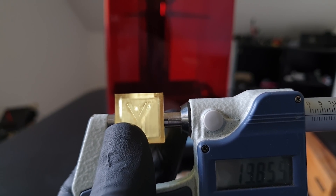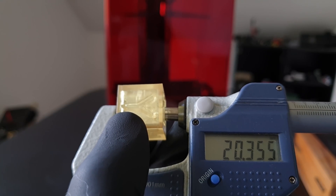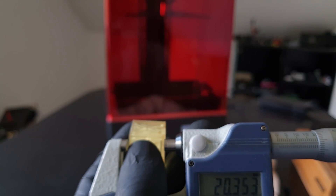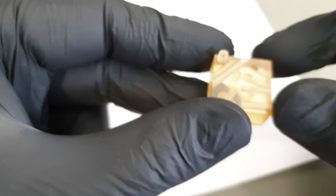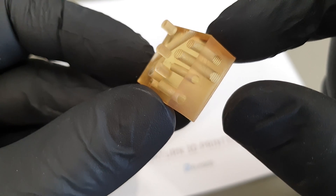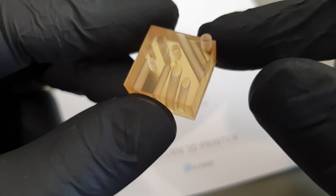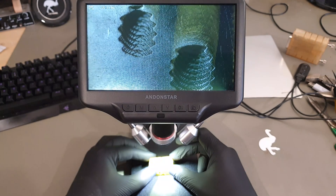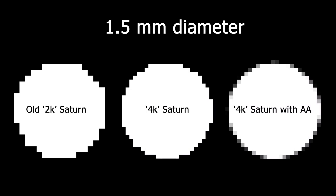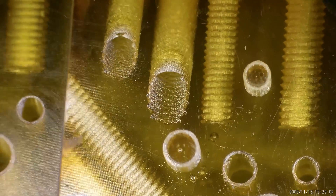Back to smaller parts where none of that really matters. I got a bit of an unexpected result from the calibration cube — the Z-axis calibrated with a piece of cardboard turned out to be better than the Y-axis, which was only 0.15 millimeter off, so also pretty good. Printing small threads has been kind of my benchmark for SLA printers. Laser SLA machines are good with surfaces, I'll give them that, but microscopic features like working M3, M2.5, and M2 threads — I'd like to see them try. I made two of these to compare normal voxel results and results smoothed over by anti-aliasing, but I forgot to mark which one is which.